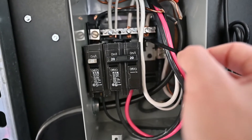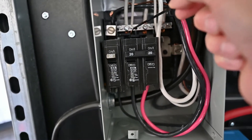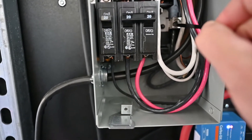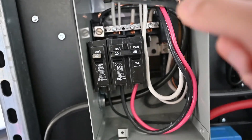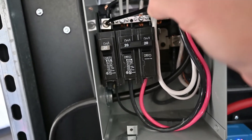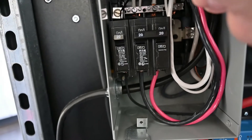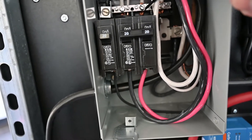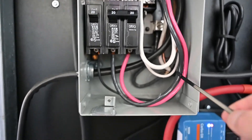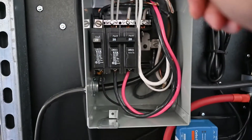This is inverter number one here, and inverter number two over here — every other pin is connected to the 120 leg. On the top, the left-side inverter comes in and its hot leg is connected to this terminal, which connects to the alternating pins over here. All the neutrals are tied together up here, and all the grounds are tied together up here.